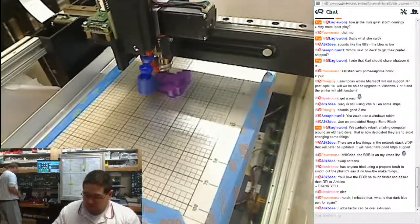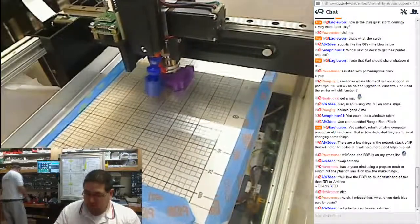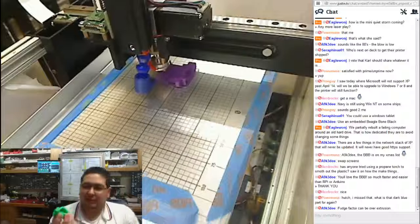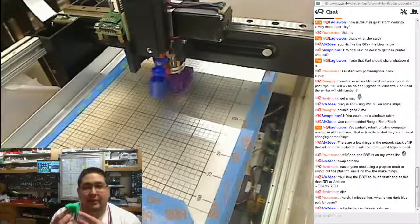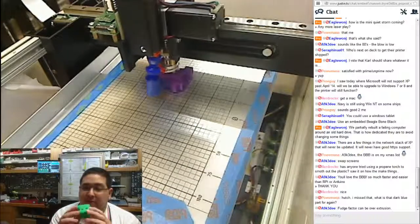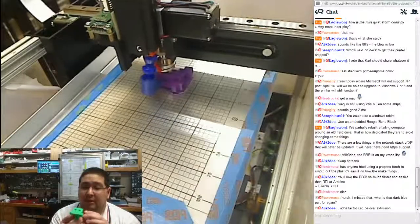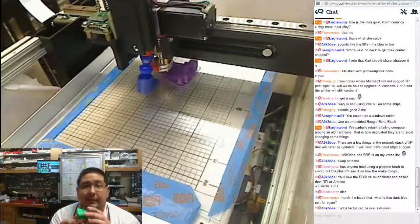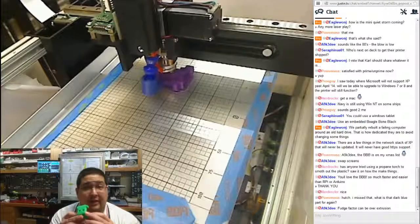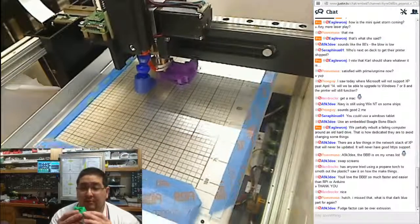Okay. One thing I will share with you guys is that when you do want to print certain particular shapes and pieces, we're finding that there's no shame in putting a nice little chamfer, either an edge chamfer or using a fillet around on the actual corners. It actually makes the part come out quite nice. So don't skimp on using the chamfers in any one of your CAD programs, because the finish comes out a little bit nicer than what we would have expected.